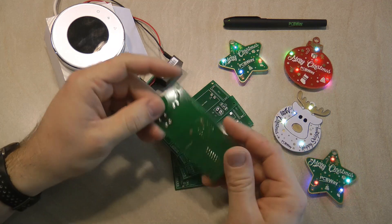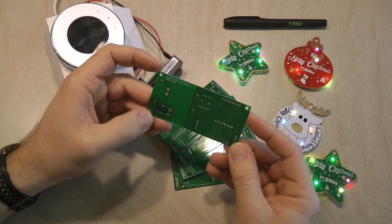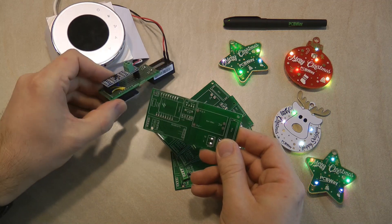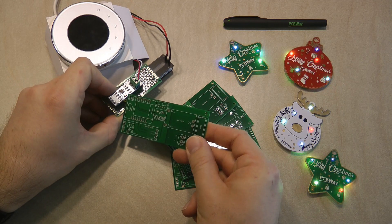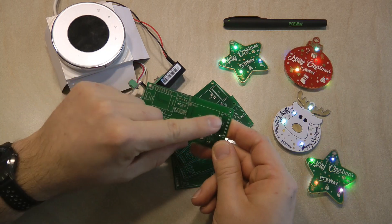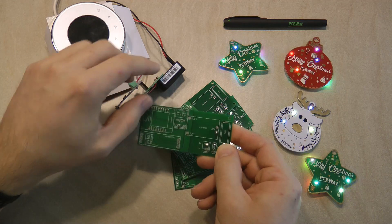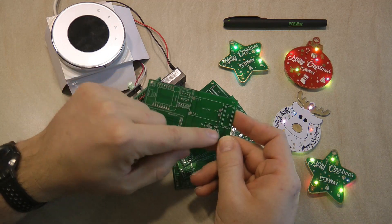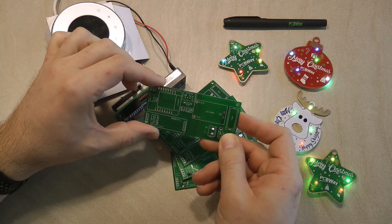And this is my ESP8266 Modbus board. It's basically pretty much the same as the previous one — you have the ESP module and this version of the TTL to RS485 converter chip. Besides that, I put a place for a power supply, and I also put a fuse and a MOV in case you want to add those as well.